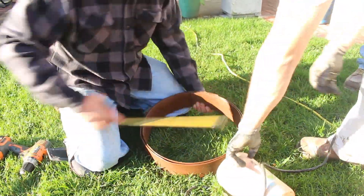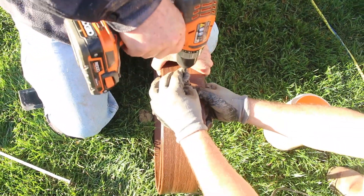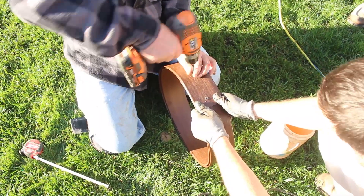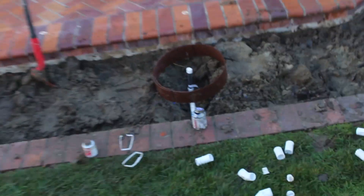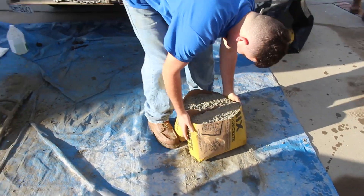You can see I've rerouted the sprinklers to each new planter location. A potted plant is going to go in these locations, and it'll route the water up to the bottom of the planter with a little bubbler at the top. There'll also be a drain in gravel at the bottom of each hole, so if there's any over-watering of the potted plant, the water will go into the drain and out to the street. It's a perfect zero-maintenance setup for a potted plant.